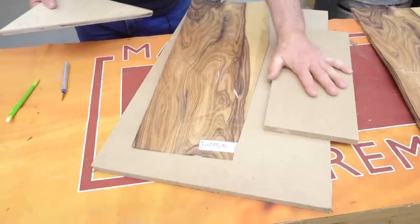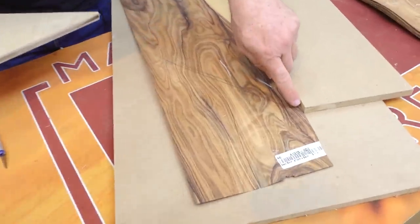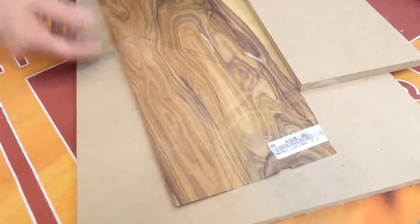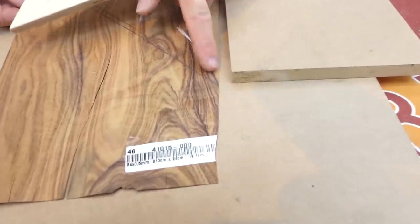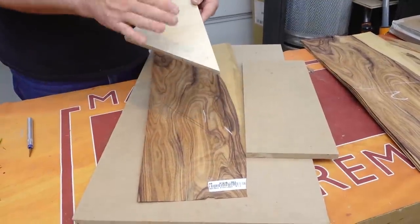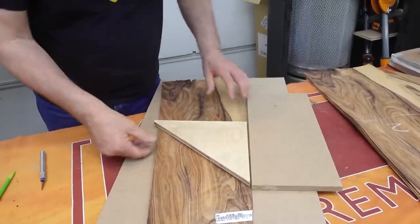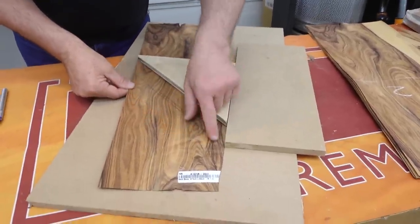What I've done is I double stuck a straight edge here. I can line my veneer right up against that. I can also use this corner to be sure that I'm right on my tip of my sapwood, right there. I can take my triangle, which is 45 degrees or more. You do not want to be less than 45 degrees. It's better to be, say, a half a degree over. So I'm going to line this up,